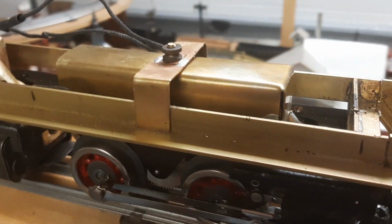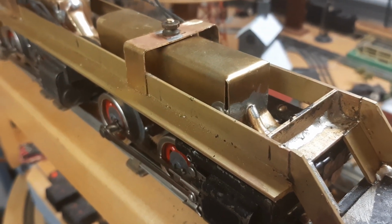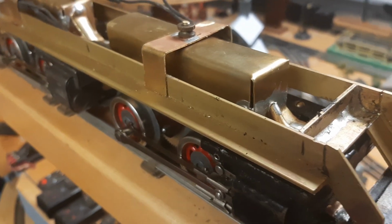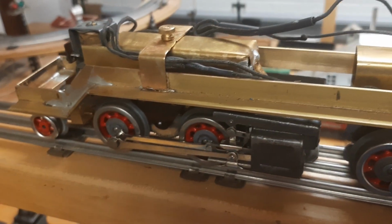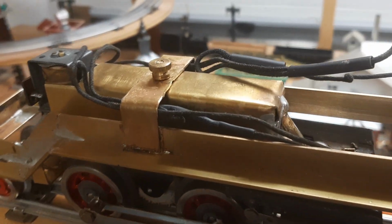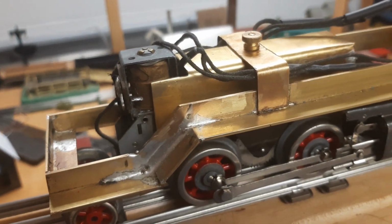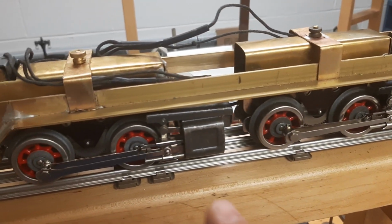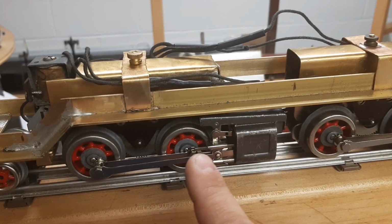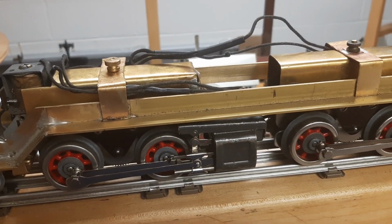So I made a little brass cage, and the little brass cage fits over top the 259 motor. A second cage was made for the back, only this one was cut out so that I could put an E unit in. What it allows it to do is each one of these linkages still run like they did on a 259, but the entire motor swivels.